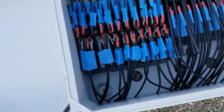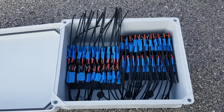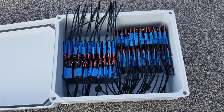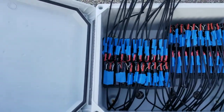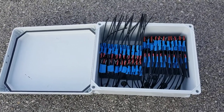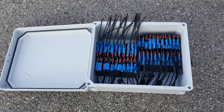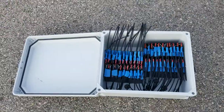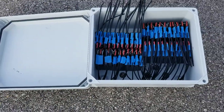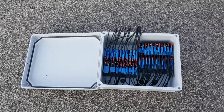Eric is really interested in seeing how everything works. I want to utilize the equipment I have at home that's just sitting there. I can grab this pack and my Duracell 400 watt — I'm good, I can run a little fridge on that. I can take two of these cases and make it 24 volt right away, or stack two pairs together, connecting positive-positive and negative-negative on the back where the studs are, and we're good to go. That's how portable I want this system to be.